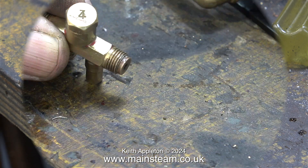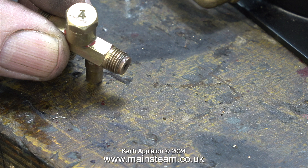All of the connections need to be steam tight, air tight, and water tight. This is moderately interesting — it's a number four Jubilee Fittings injector and it has a number four stamped over the top of the number three. I guess they must have run out of caps when they were making a batch of them.